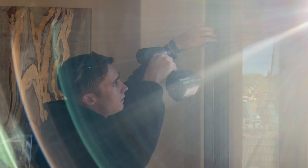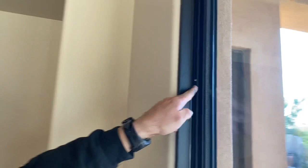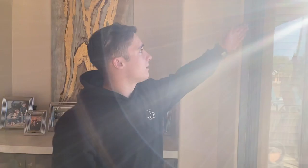One of the ways you'll be able to know that you set the screw in the right place is there should be no movement in the stationary panel on the back side anymore. That screw has gone through our frame into the style of this panel and it's now sucking them basically right on top of each other. You can see it's in the channel, it's holding that panel together, and the panel's not moving when I push on it. We're going to touch up paint that. Also, if our brackets for some reason start to fail over time, these screws are a backup — or you can think of it as everything working synergistically together. So this is for safety and for the longevity of this door. Hope you guys have a great day and we'll catch you on the next one.